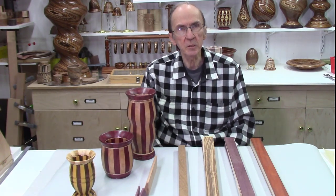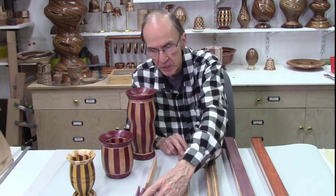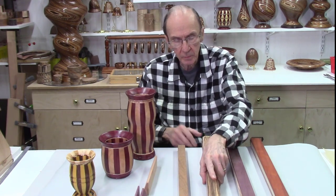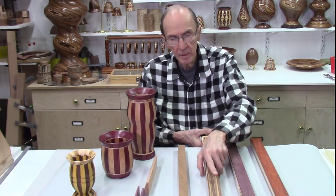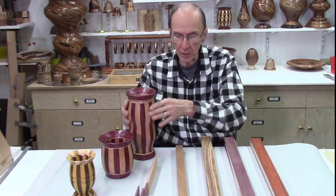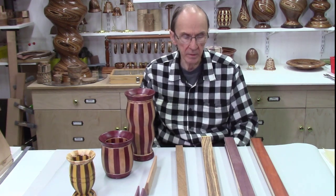In this video, I'm going to do something a little bit different. I'm going to make alternating contrasting layers for my wood. So instead of being a solid piece of wood such as these purple heart staves, I'm going to be making boards that have multiple layers — anywhere from three to a dozen layers. As you carve and turn them on the lathe, you'll expose the other layers and get some nice patterns.